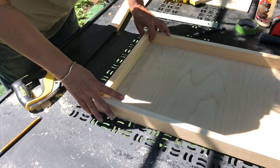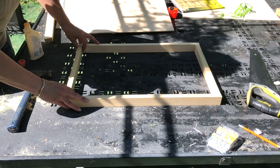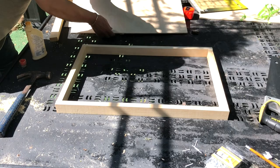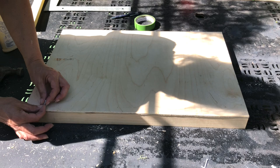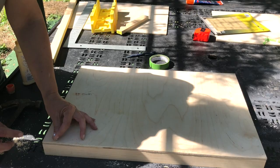So now we're going to glue these in place. We've got our four pieces and we just want to put them on a level table, make sure all our pieces are lined up, add glue all the way around, then take our base, square it, and use our panel nails — they have a small head — and add them all the way around the tray.